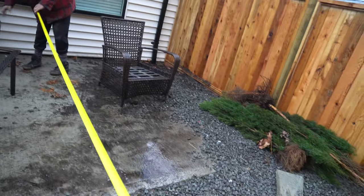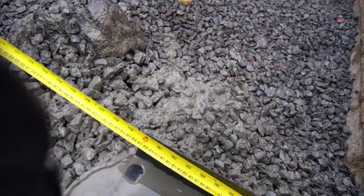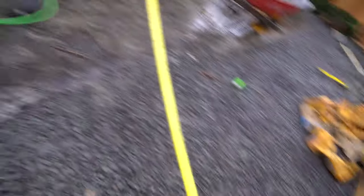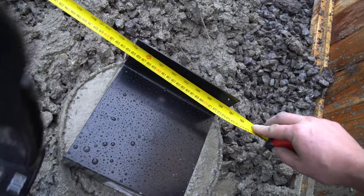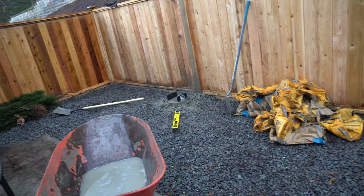Tariq is going to hold the tape against the house to show you. Same height on the other side — if we pull it tight you can see it's 179.5 inches. We're one seventy-nine and a half on both sides, within an eighth, which is perfect — that's what I wanted. So we know those are square. You just need to watch them as they set. Today we are going to take the siding off so we can put our structure up.